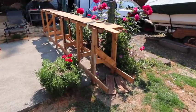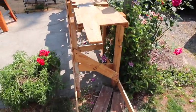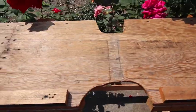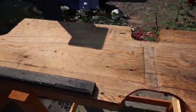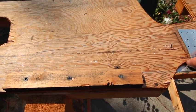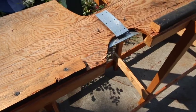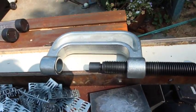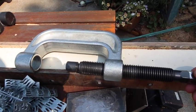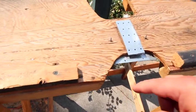We're here at mom's house at my workstation set up to build trusses. You can see the outline for the original that I traced, and I cut out around here because the tool I have to compress the plates — the mending plates, gang nails, whatever you want to call them — it's basically a ball joint press. It only has so much space that it can go in.